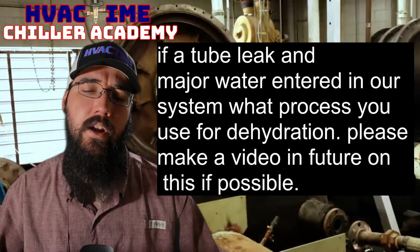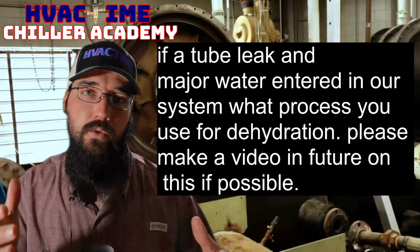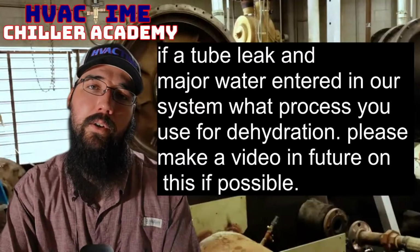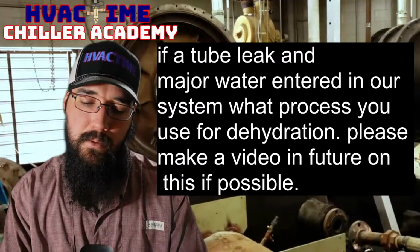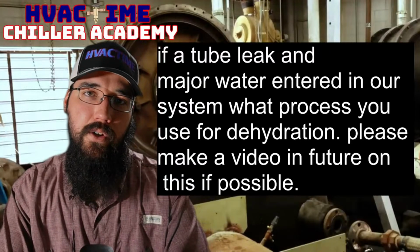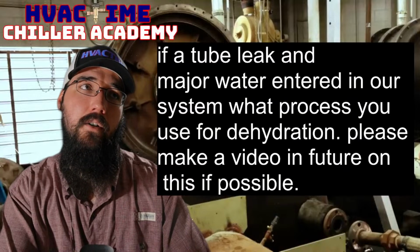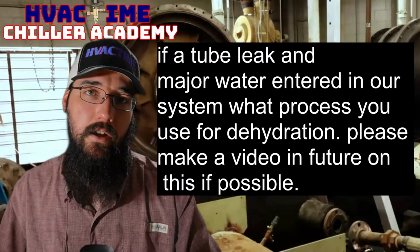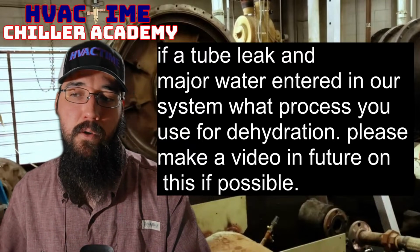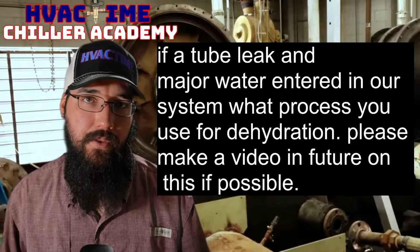A cold trap is a big cylinder that the vapors coming through the hoses go around the larger part of, and inside the cylinder we have another interior chamber that we fill with dry ice, and some people I've heard use antifreeze. Another one is denatured alcohol. Anyway, we fill that with the dry ice, lock it all together, and what that does is instead of all the moisture coming through into your pump and contaminating it very quickly, it collects in the cold trap first. It keeps the pump oil in a more pristine state and helps you get deeper, faster, longer. So those are the two primary methods.